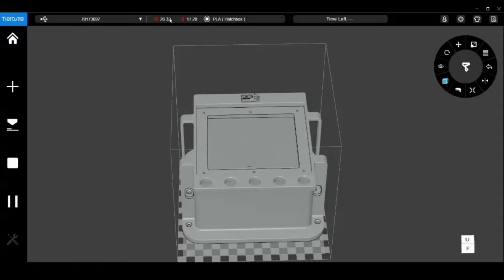What it's doing now, you can see up here, this is the temperature readout. We're at about 11:30-ish up here in the top header. We're counting up, this is the temperature of the print extruder head. This is going to have to get up to around 200 degrees C before the printer will start printing. Once the printer starts, I will end the screen capture here. I think I have the PLA tough set a little higher. There we go, 210C.